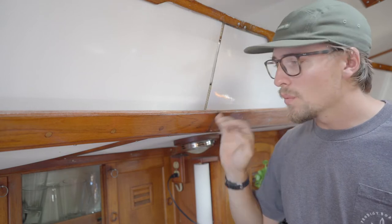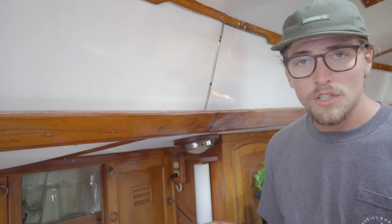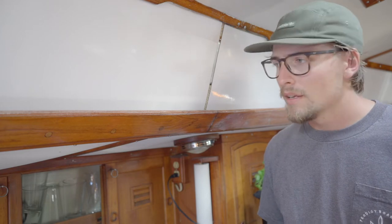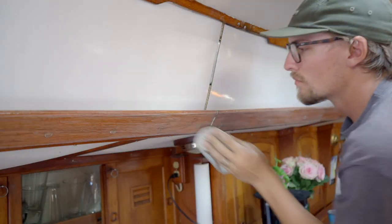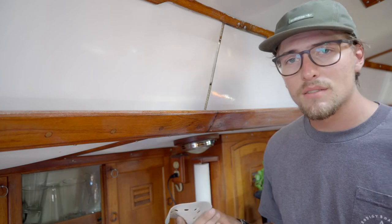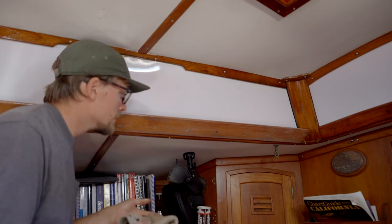We're inside the boat now working on the handrail. This has six coats of varnish on it, and I still have a good amount of grain showing in the top coat. To fix that, grab some sandpaper — I'm using 320, you can use 220, but I wouldn't go anything lower than that. You want a high grit so it's not going to score the surface. You're just going to run it over the top, keep going until all you see is white, and try to sand until those low spots are also getting hit. When you do the sanding routine between coats, you're flattening out the last top coat and getting rid of the grain. Right before you start varnishing, grab a rag and get it damp with mineral spirits, and just wipe down all of the extra residue. Then you'll be ready to varnish.